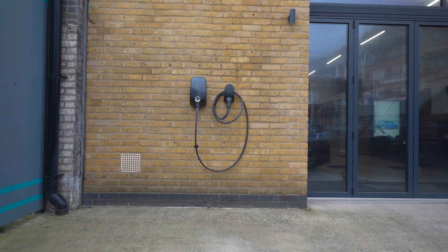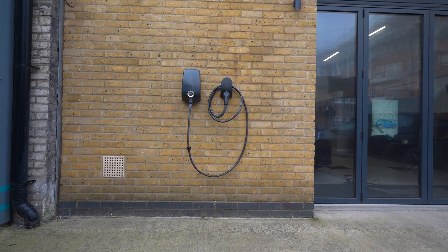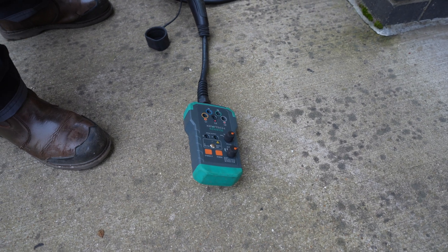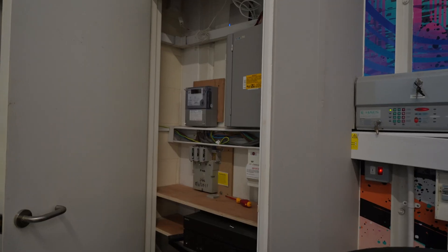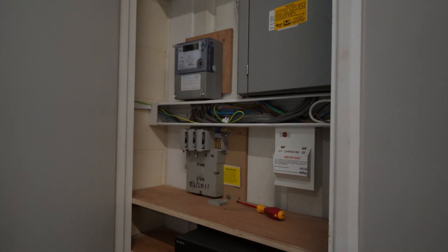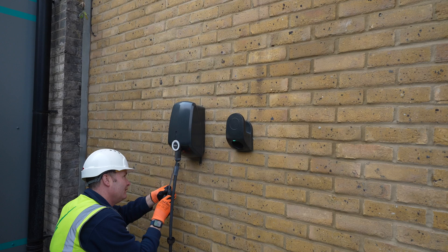So this is your last glimpse of the old one — in with the new one. Before any work commences, the power is checked using a type 2 tester. All three phases are good, so after inspecting our utility cabinet, the supply is cut to safely start removing the old EV box unit.